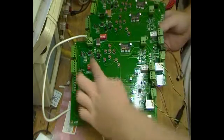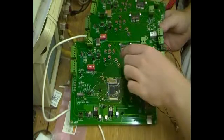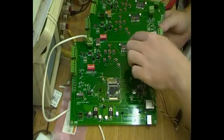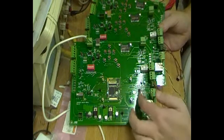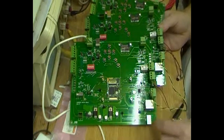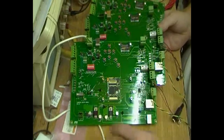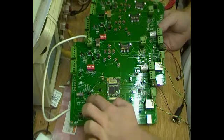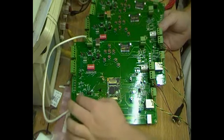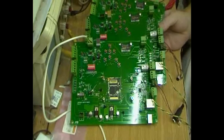Quick tour around the board one more time: RS-232 or USB to serial via jumper header; menu navigation buttons; SD card; one-wire bus; relay; single transistor output; MP3 on a VS1002; Ethernet; USB peripheral; regulators 3 and 5 volts; Embedded Master module; LEDs and an option header; real-time clock battery; USB host; one-wire output; 8-way DIP switch; and RS-485.